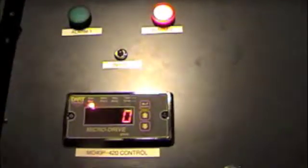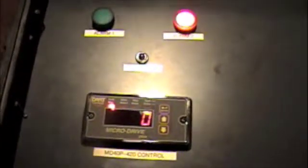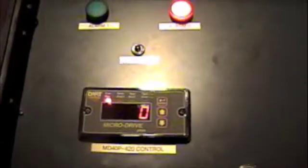I'm just trying to show everybody this so that you can get a feel for what you can do with the user assignable outputs. Basically, they're programmable for whatever the customer wants to do. Please refer to the manual on setting your user assignable outputs to see how you do it. You can AND or OR them together, so you can have more than one condition make an alarm go off.